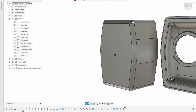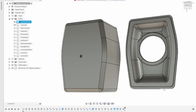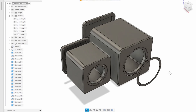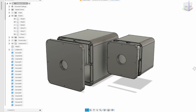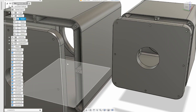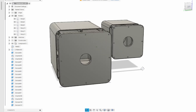I split a part of the front from one of the other boxes and made it to match the Jesmonite case. Jesmonite is a heavy microcement I can easily use in these enclosures. I wanted some compact subwoofers and decided to go for sealed boxes in two different sizes — the smaller case for the 4-inch driver and the larger one for a 6.5-inch driver. Both should be filled with Jesmonite microcement to make them heavier and less resonant, with room for filling around the front and back plates as well.